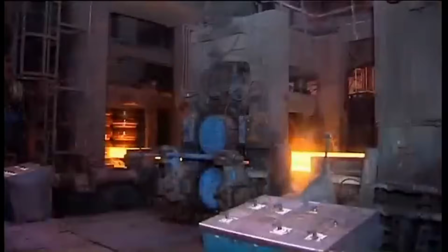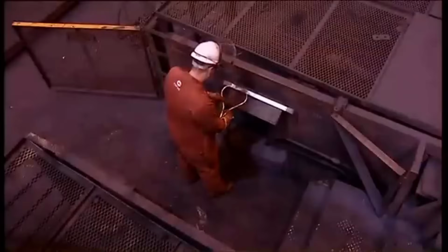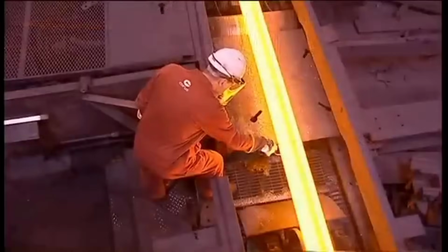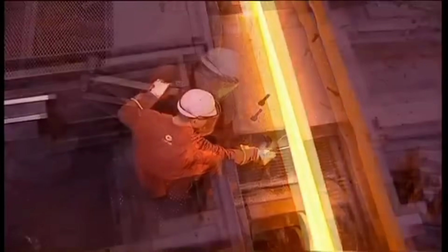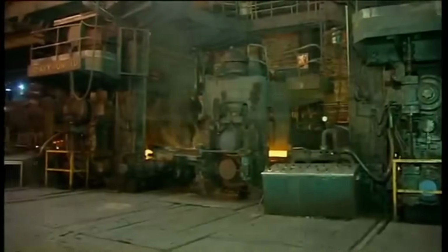Within this mill, a series of precision passes and tilts further shaped and reduced the bloom size, ensuring it met precise dimensional requirements. The assistant roller at the exit meticulously calibrated the product size, guaranteeing it aligned perfectly with customer specifications. This stage readied the bloom up to 90 meters long for the final stages of production in the continuous mill.